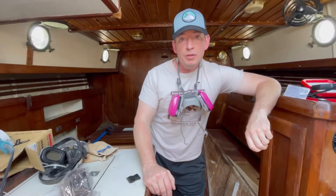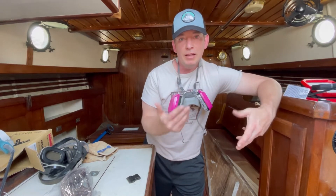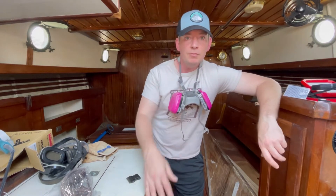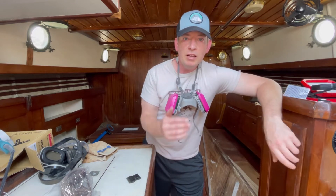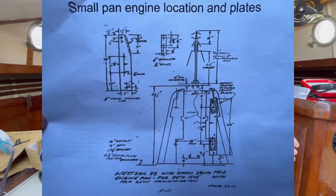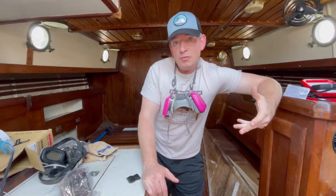This is the final part three video of installing a Betamarine engine with the jig. You'll actually see the engine drop down onto the mounts and that final installation in future videos. Ultimately, the jig allows us to position exactly where the engine will be and where the aft coupler from the engine is flush with the coupler of the drive shaft. That's what the jig is for.